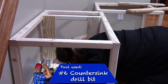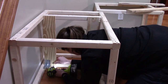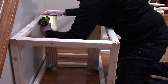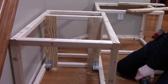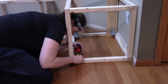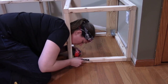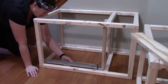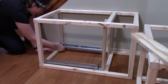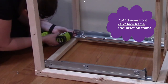I am pre-drilling with a number 6 countersink drill bit and driving in one and a quarter inch screws. I'm marking on the frame where I want the drawer slide front to stop. My drawer face is going to be made of three quarter inch material. I want the drawer face to be inset with my face frame, which I'm making from half inch plywood — you can check that out in my next video. So I want to make sure my drawer slides account for that three quarter inch material and my face frame, so I inset them a quarter of an inch.